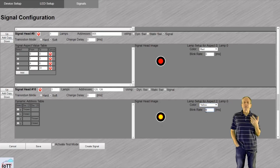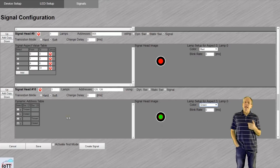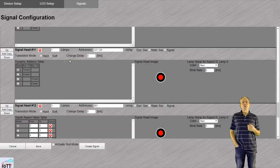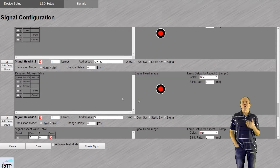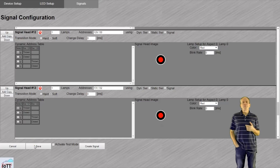Aspect 0 should light the red LED, so I selected red. For aspects 1 and 2 I selected yellow, which of course was a mistake. Yellow, as defined on the NeoPixel, makes use of the green and red LED to mix yellow. However, since this signal has individual LEDs, all yellow does is bringing up the red and green LED at the same time. The yellow LED in reality is connected to the blue output, so in order to make the yellow LED come up, I need to select blue as the color. I did that later after figuring out my error. For the RGB LEDs, of course, this is different, as they will generate yellow using green and red, but they also have a blue LED on board so they can generate the entire color range.